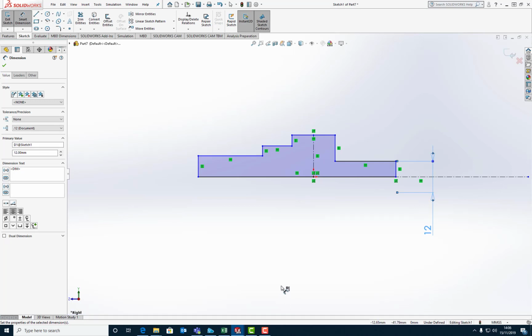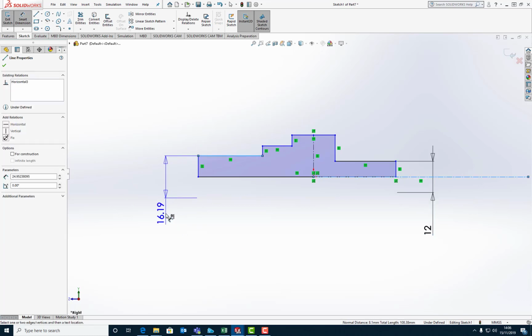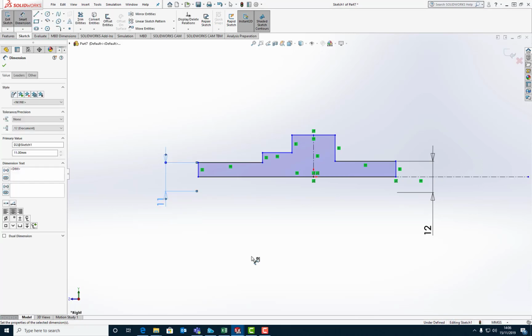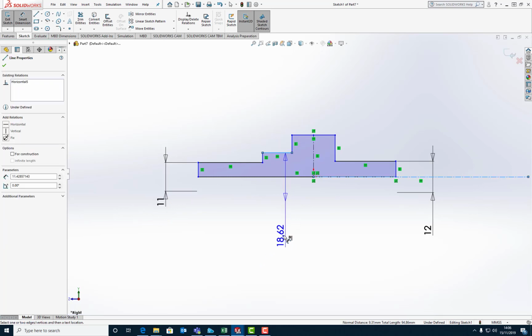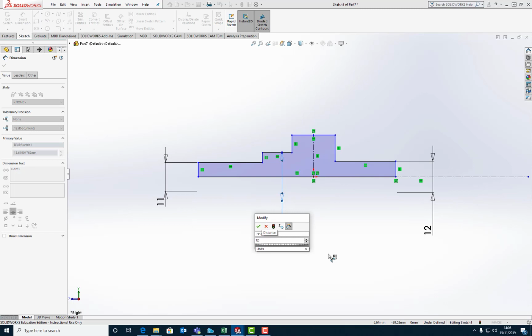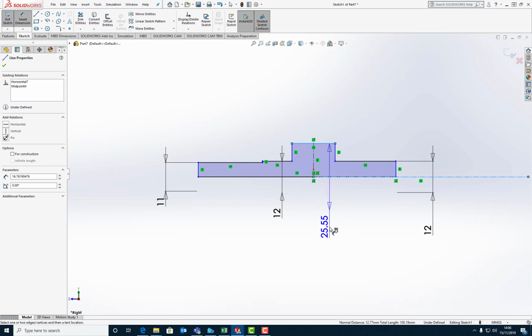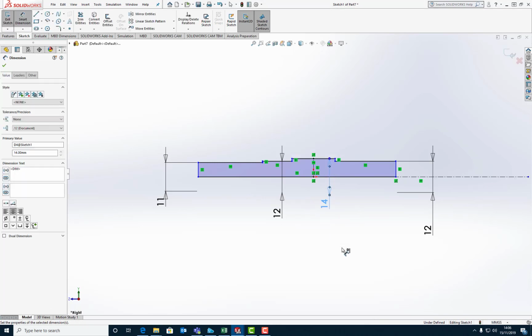We can then click on all the other lines that are horizontal and it will create diameters. And we're going to set this input stub to be 11. This bearing diameter to also be 12. And this gear segment to be 14. Here we go. That's easy, isn't it? Okay. Then obviously the whole thing is going to revolve about this line, but it's still blue on there. Obviously, because those blue lines haven't been located relative to the origin in any way yet.